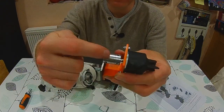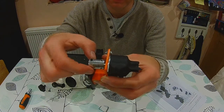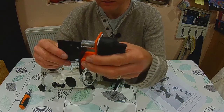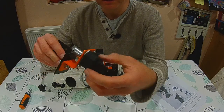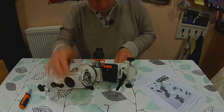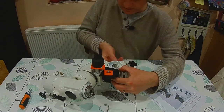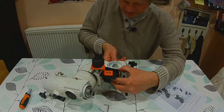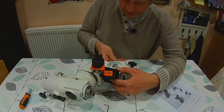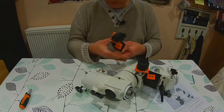You can see they've actually cut into the metal on the joining piece to create a spring effect - so that's basically a spring, meaning if it goes under any tension it will just compress. I think that's really clever design. I'm not tightening this too tightly because it's only screwing into what is probably three-millimeter steel - it just needs to be finger tight. That's the right ascension motor done.